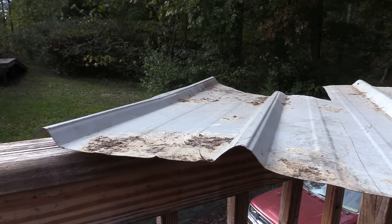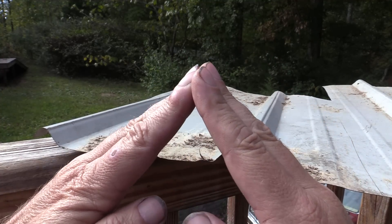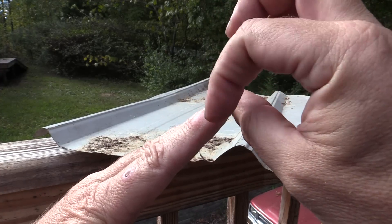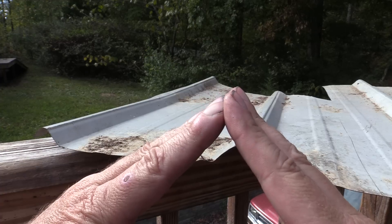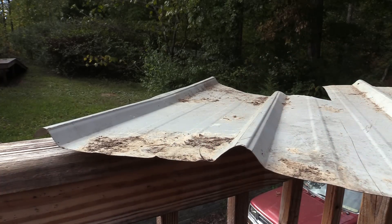When I first started doing metal roofing 30 years ago, we installed 5V which, like it says, has five V's, and you would nail coming straight at the top of that peak. You'd actually have to take a hammer and dent it a little bit so you'd have a flat surface, and then drive your nail into that peak. There was a rubber washer, but prior to that there were lead washers, and basically the head of the nail was what was really protecting the water from getting in, not so much the seal of the washer.